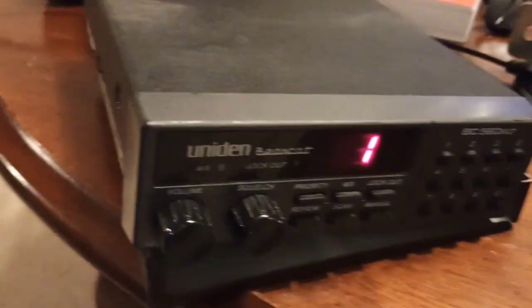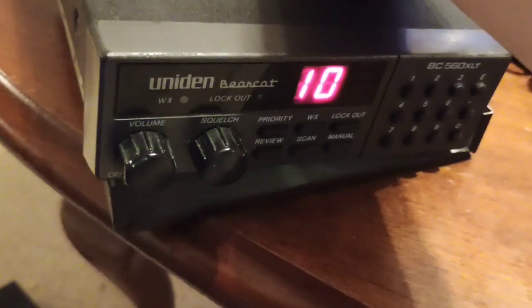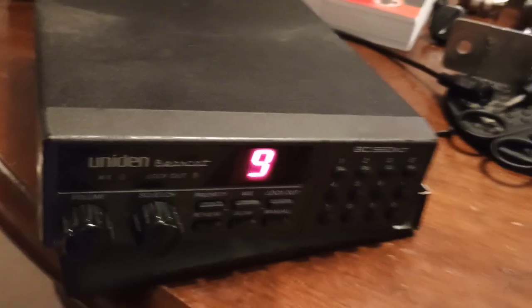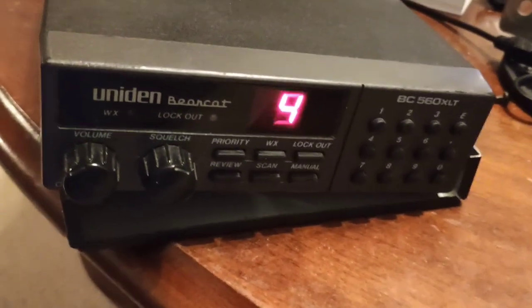Well, update. I took apart the radio. It does not stop on the mother frequency that I put in. Mess up the squelch, and it stops like it should. There is no audio output whatsoever. There's a slight hum with the external speaker hooked up, but there's no audio output, no squelch noise, no static, no nothing. This is a second Uniden scanner I bought from maybe the mid-90s.